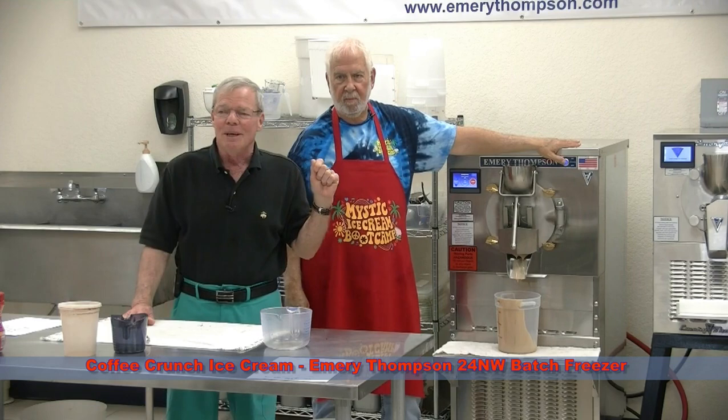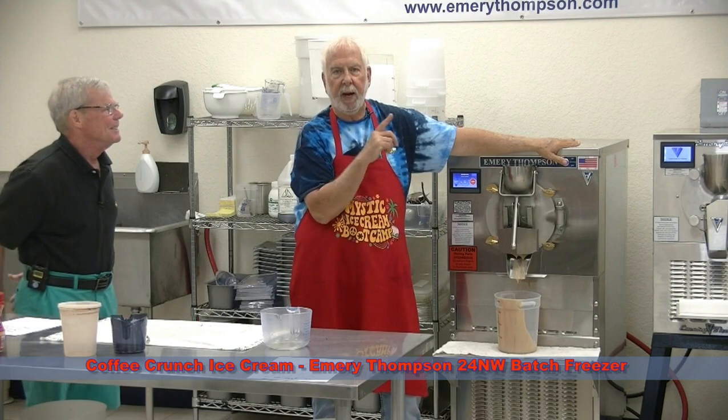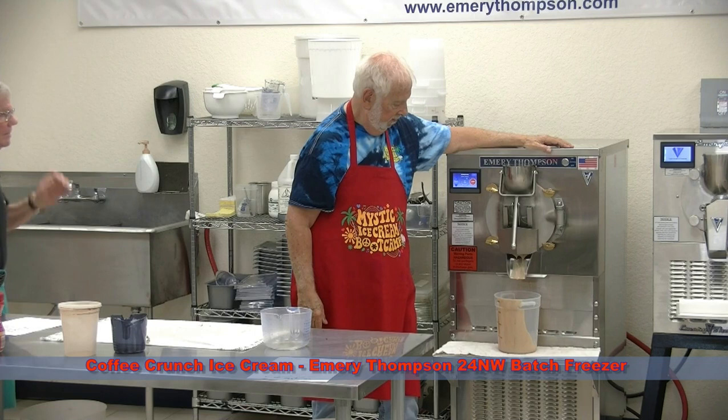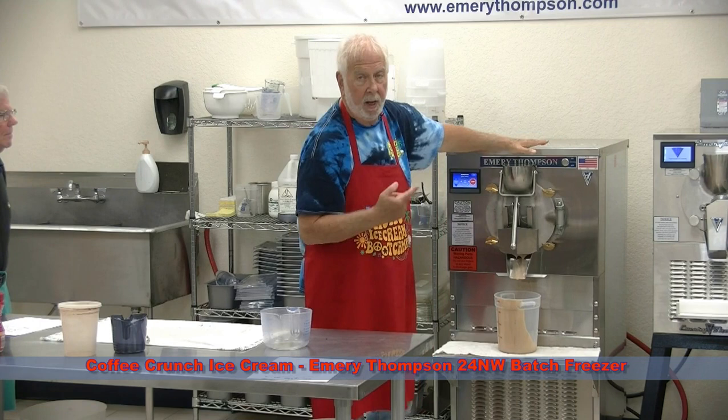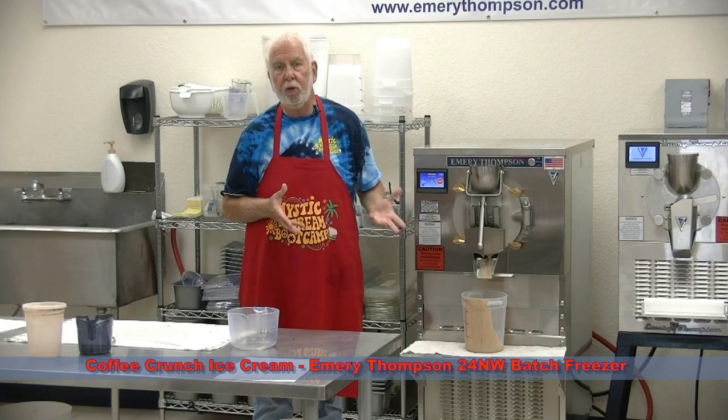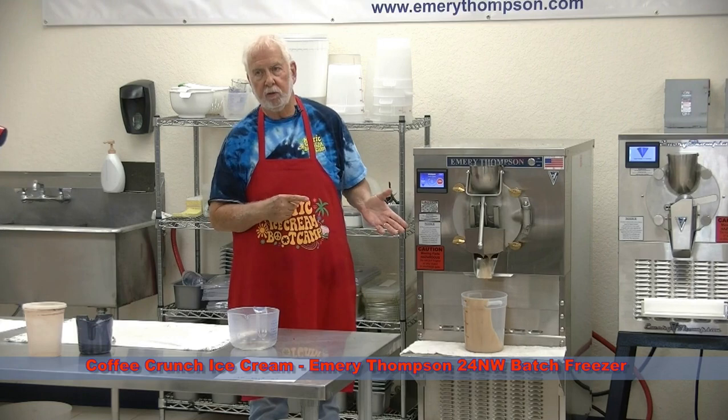Okay, here we go. We're going to pull it. So I do the same thing in reverse. When I shut it, I want to hear the compressor shut off. The water will stop in the sink. There we go. Okay. Now I feel comfortable doing it. When you pull it, when you extract it now, the cylinder where the ice cream is made is canted 5 degrees. So this thing will shoot out of there, filling your buckets like that. I'm going to do it a little slower so you can watch what happens.